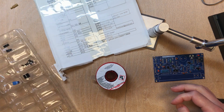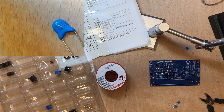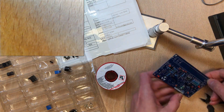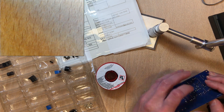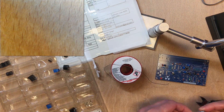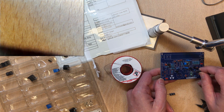There are some jumpers here, which implies there are settings to work out. More ceramic caps — code 103 is 10 nanofarads, going into C6, C7, and C20. Then C1 and C2 are small electrolytics, polarity marked with a plus side, and the white stripe indicates the negative side.